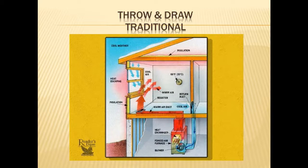Okay? We want that air to go up the window because it's fighting the cold air that's trying, see, you've got hot air on the top of the room, but it hits the window. It gets cold and starts to fall. And that's why, particularly on a patio door or a very large window, you'll feel the draft, even if there's no leaks in the wall. You'll feel the flow of air coming down. So we fight it with the hot air going up.